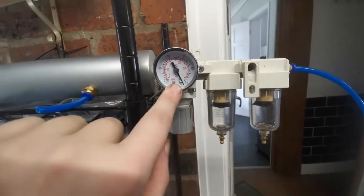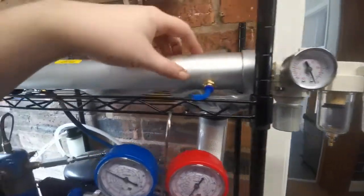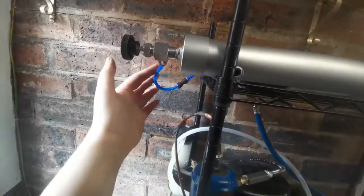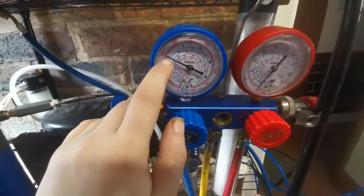So here we're running — oh, that's a bit naughty — about 11 bar. This goes into the separation membrane; oxygen-rich air comes out here, and nitrogen makes its way all the way through to the end, out here and into this gauge set. The output is about 10 bar at the moment.